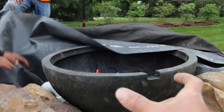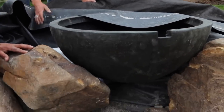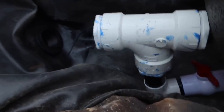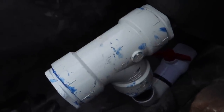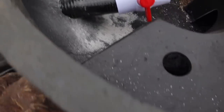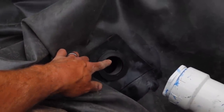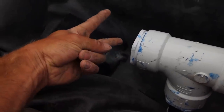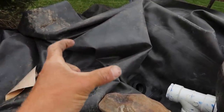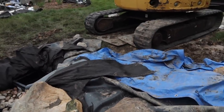We have a ball valve down below for supplemental water. We have a 5-to-9 pump on here which might be a little aggressive, but we love the flexibility of these variable speed pumps to really dial in that flow. We're going to cut this notch open nice and wide, but that will only give us probably two to three thousand gallons per hour. We want to supplement that with another three to five thousand gallons through here. We ran a manifold back in here — we've got our three-inch tee, then three-to-two reducers all the way around. One pipe goes into the side of the spillway bowl for the patio pond, the other shoots straight down and elbows, with a ball valve on that. We put ball valves on both so we can really adjust that flow. We also have a bulkhead fitting coming in through the liner — that's where the plumbing will come inside the liner and feed this manifold.